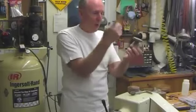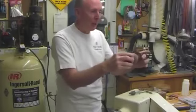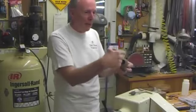Here's the bottom, which will get connected, and you want to be very careful about lining up the grain, because when you go to make the glue joint in the bottom, if the grain is lined up, that helps to hide the glue joint.